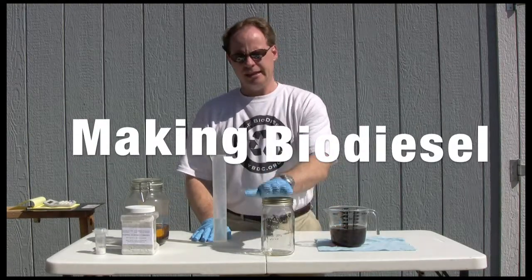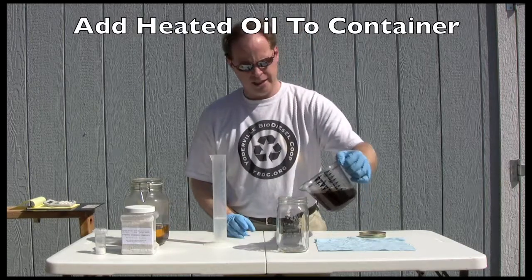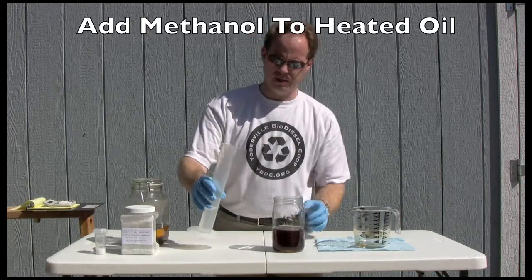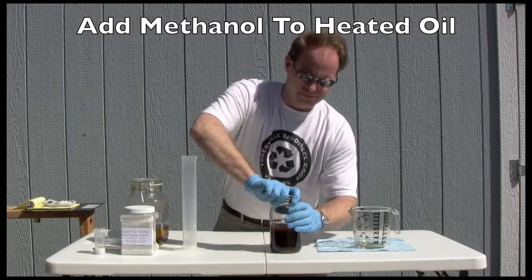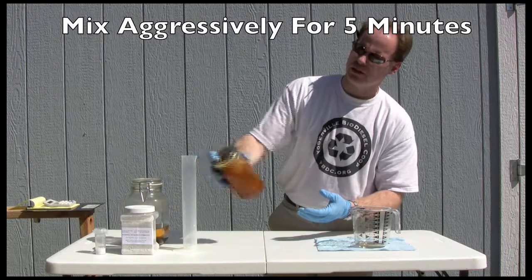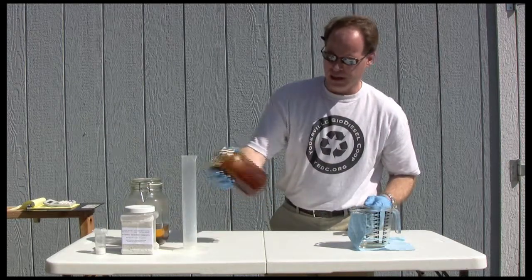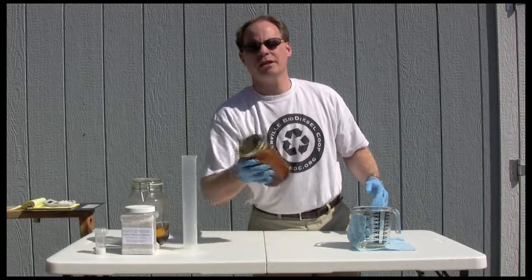When you're making it in larger equipment, you want to heat your oil up to about 130 to 135 degrees. You don't want to go over 145 because we don't want to start boiling your methanol off. With our catalyst dissolved, it's now time to make biodiesel. I like to use small mason jars because they're easy to pour into — we can seal them and shake it up. I'm going to pour my oil in — beautiful golden brown color. And I'm going to take my 80 milliliters of methanol and potassium hydroxide and put that in there. As I begin shaking this, the color is going to change almost immediately — I'll stop a couple of times to show you.